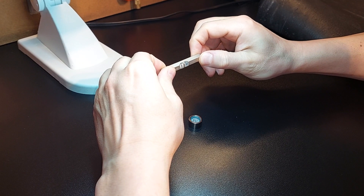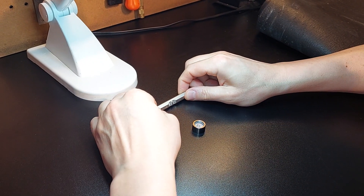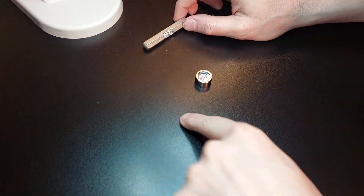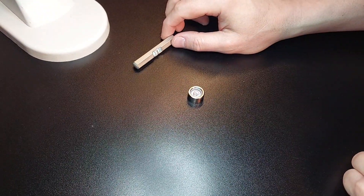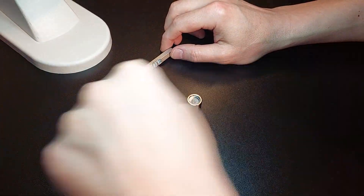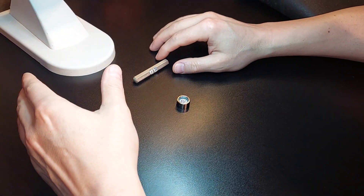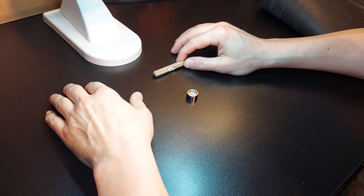That means your X-axis, when it comes across, we want to make sure that you're not teetering on either side to make sure that the unit is level. Your spoilboard — if we look here and you see the level is actually off — you'd want to make sure it's perfectly perpendicular to your spindle. You also want to make sure your spindle is perpendicular to your actual spoilboard or your CNC chassis base. We want to make sure that when we're cutting, we're not on an angle, because that brings forth a whole slew of other problems.